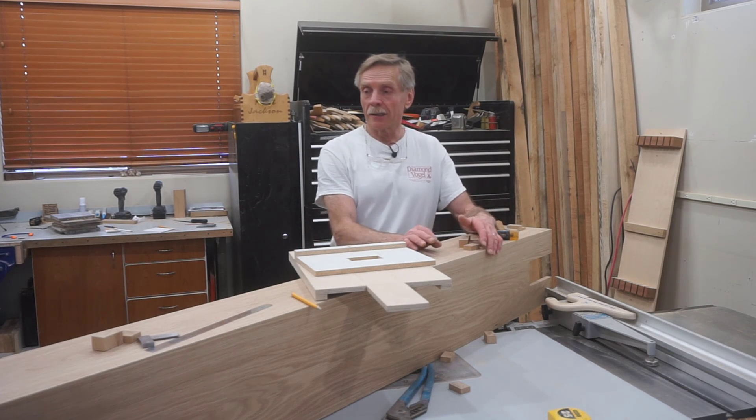I'll drill a couple of relief holes in the corners making sure I'm inside the final cut lines. After the tenon is marked and the relief holes are cut, I use a small circular saw set to full blade depth to cut out the waste around the tenon. I make sure to stay proud of the layout lines by about a sixteenth of an inch, then cut just as tight into the corner as I dare so that the scrap comes out easily — avoiding the danger of cutting past the line and spoiling the workpiece.